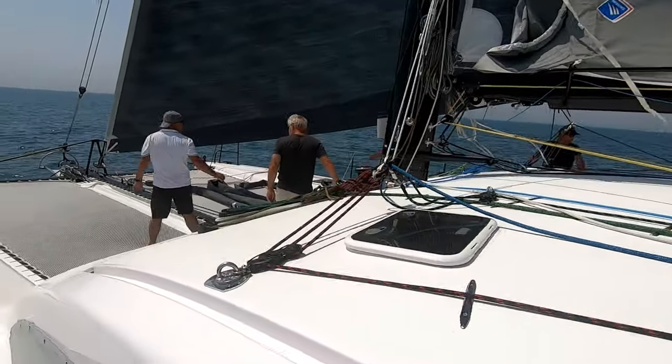In the case of so-called performance cats, composites are always the reasonable choice to have, because if you do maintenance and keep those sails in good shape, they can actually last just as long as lower cost Dacron sails, which will tend to stretch and get out of shape very quickly.